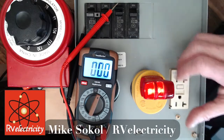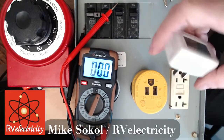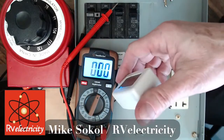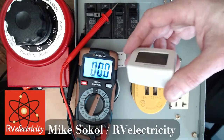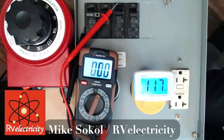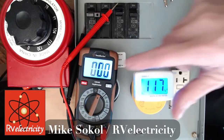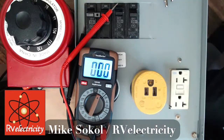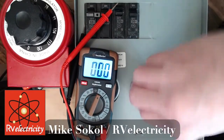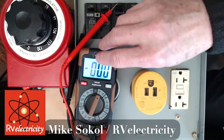There's no GFCI on this anyway, so you don't have to worry about testing that. That works really quite well. For those of you afraid to use meters, you can get these little guys on Amazon for eight or ten dollars — I got two for sixteen bucks. They work quite well; it's within a couple of volts of my big meter, though this one's adjustable and can be recalibrated. It starts to show you that you have voltage and proper polarity.